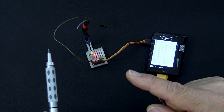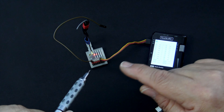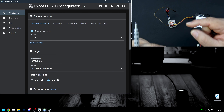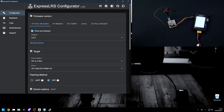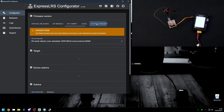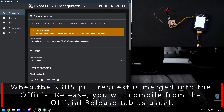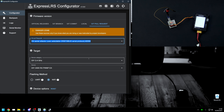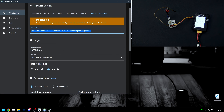The next thing we're going to do is go over to the ExpressLRS configurator and compile the binary that we're going to put on this receiver. It's important to understand that as of early March 2023 the SBUS code has not been pulled into the mainline branch of ExpressLRS yet, so you really need to treat this as experimental. In the configurator go to 'Get Pull Request' and select RX Serial Refactor number 2094 — that's the one that has the SBUS code in it.